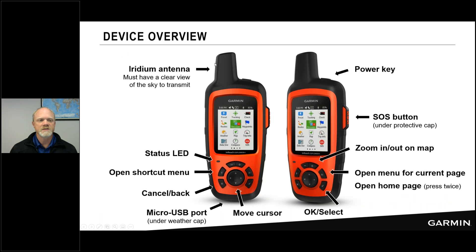Looking at the physical device: the antenna is at the top — keep it pointed up toward the sky. Holding the device upside down points the signal toward the ground. It's a helical antenna like a mushroom cap. The only weak signal point is directly out of the bottom, so keep it pointing up — clipped to your pack or in the top pocket of your backpack. The LED button reports things like messages waiting, trouble sending, or low battery.